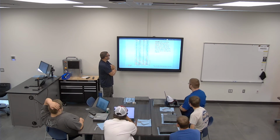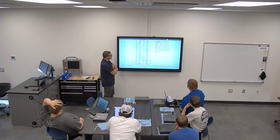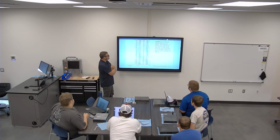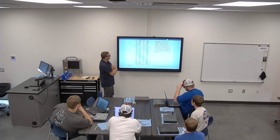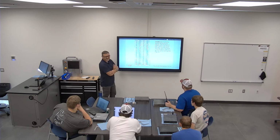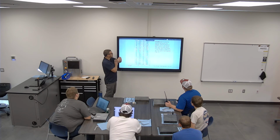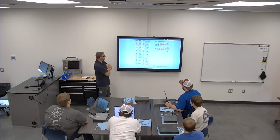Okay. Eric, 9/64. Nine sixty-fourths. How do I say it? 140 thousandths of an inch and 6/10. Yeah, so 140 6/10. Or you can round it up to 141 thousandths. Okay. Tell me your name again. Brian. Brian, do 5/64. 78 thousandths. Yeah, you could say 78 thousandths 1/10. But yeah, 78 thousandths is where we're at on that one.